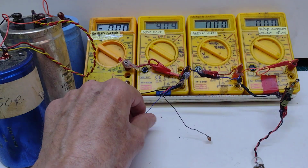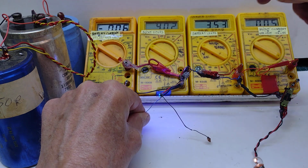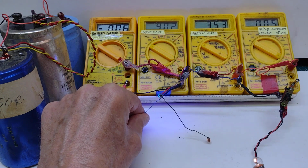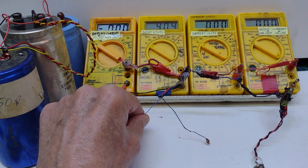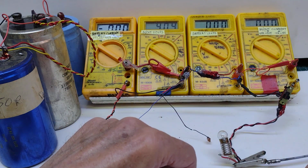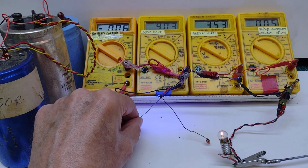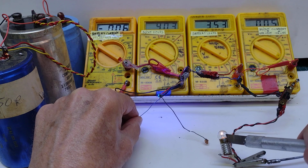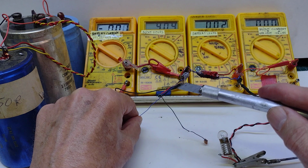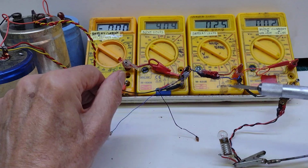Now of course if I turn it on, I can see the voltage doesn't go down as far, and I'm only getting about 50 milliamps, is it, of current to light the torch bulb. So this also shows me something else, that if I leave this on for longer than about 10 seconds, then it will actually go off. It'll shut itself down, will this chip, and it flashed there, I don't know if you noticed, to say it had been on.